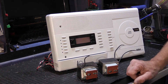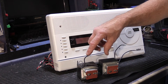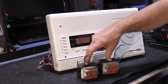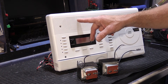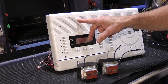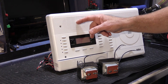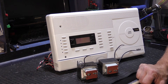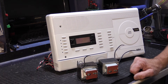Those are really two separate and different things. And the reason it's important to know is: if you repair a set of transformers that have blown fuses and you reinstall them, and you reconnect a master station — a 4406 — that has some kind of internal flaw or fault in it, all it's going to do when you flip the breaker back on is blow the fuses again. And then you're right back to where you started, other than the money you're out for having them fixed the first go around.